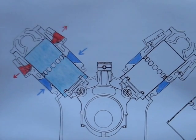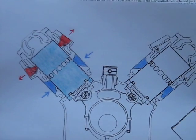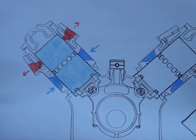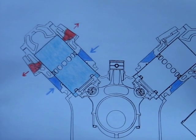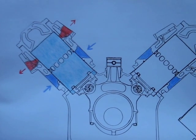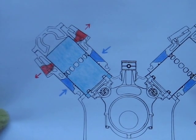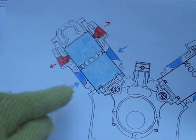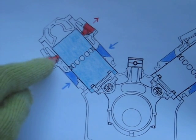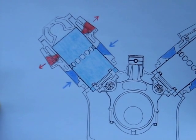I've colored in some drawings here. This is a cross-section view of the engine. As you can see, it's a V engine, V12. It was intended for aircraft, but it was never used in those — it never actually flew — but they did build six full-sized engines. It was a direct injection gasoline engine. So what we have here is the sleeve. It's also a two-stroke engine, so it fires every time. The inlet ports are down at the bottom of the cylinder, and they inlet through the holes in the sleeve. And the exhaust, when the sleeve comes right down, it exits over the top of the sleeve into the exhaust ports.